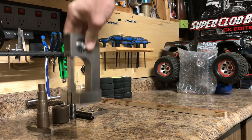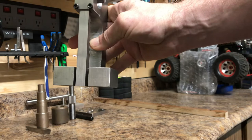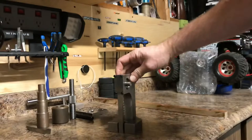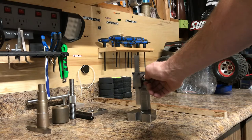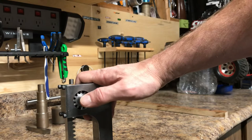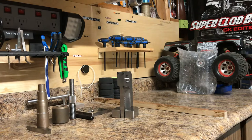For second level — I haven't finished this yet, I've just started — this is a mini arbor press, and I thought it was cool because I could probably use it for some RC stuff. You do this on mills and the lathe. You've got to cut the rack, cut the gears, and machine everything yourself — the angles, drilling, and tapping. Once finished, you get a little arbor press. I still have to make a hub that gets reamed out as a press fit on the gear side, make my handle, and machine a slot here for a large screwdriver.